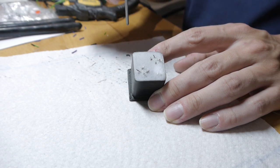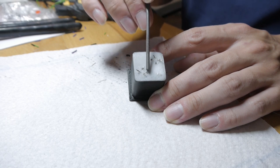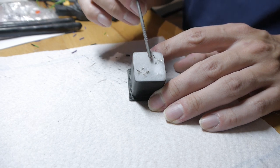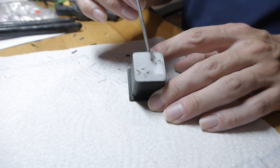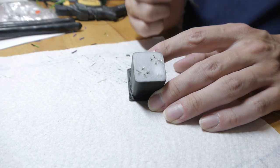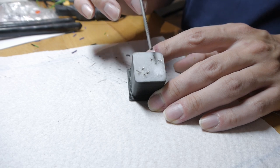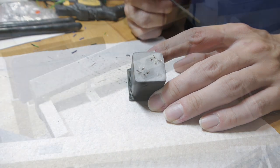And then with a green switch wire, I come here to this first switch pin, and then I only have to connect these two, the switch pin and the last short LED pin, with a black wire, because they are sharing a common ground wire. And so I have a purple, a green, and a black ground wire going to this button here.